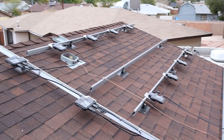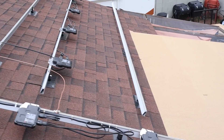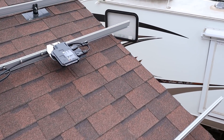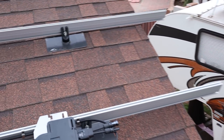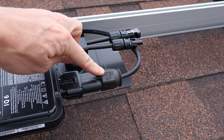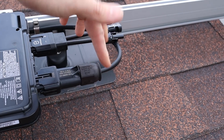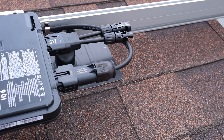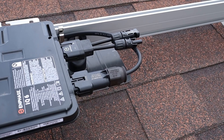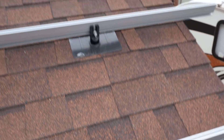On the back side, all the microinverters and Q cable are installed back here. For this one, instead of using one of those terminator caps, I ordered one of these off eBay, which allowed me to just terminate it like this. I got this whole plug off eBay, instead of just having the terminator cap like I showed you on the other one. It didn't really save any money, but the way that I ordered them, it made it a little bit easier for the install.